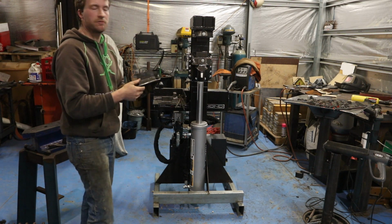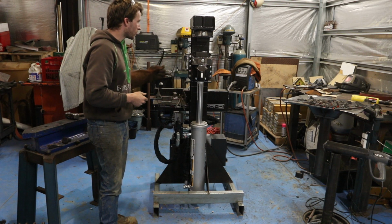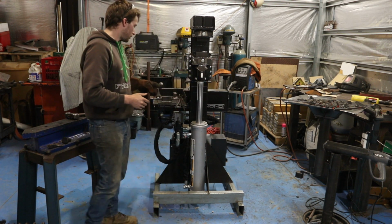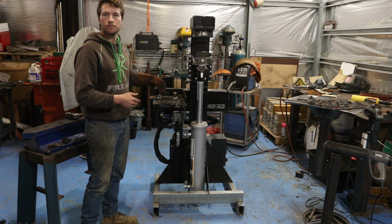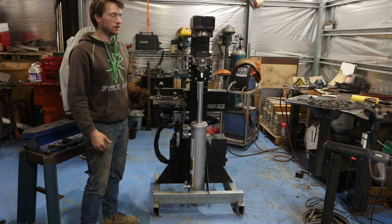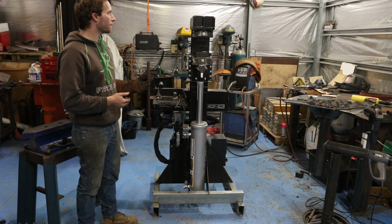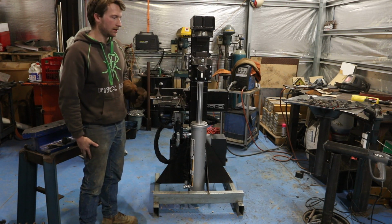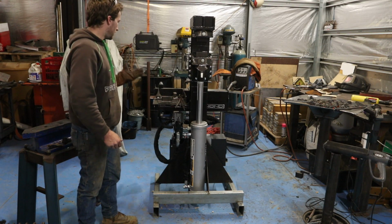But 5 plates lets you make 5 dies, and they interchange quite well. I'm using the 2 rounding dies at the moment to spread my steel out, but I've been actually drawing out with a round and a flat. So different things for different use. So far it's proving pretty universal. There'll be 1,000 different things you can make. Let your imagination go wild. Just make it strong, whatever you do.